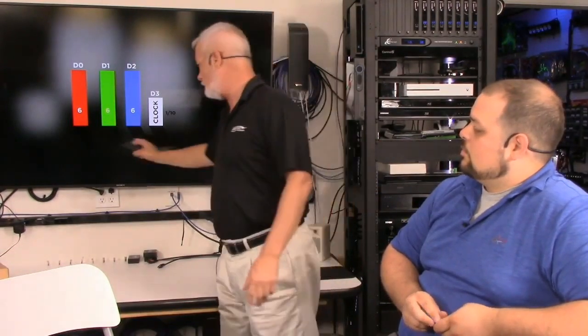Probably not. Because the vast majority of chips that support these devices really are only the first. Would you go back to the previous drawing? Sure can. When you look at switches, matrixes, splitters, extenders, the devices and AVRs and televisions, unless it specifies an HDMI 2.1 chipset in the hardware, it's really going to be this. So the first three channels are the full 6 gig. That fourth channel is probably not.